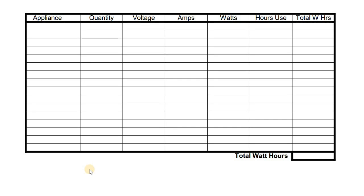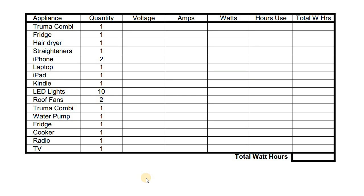Thanks to everybody who's commented on the videos — it's really helpful when you pick things up like this. So let's get into the load calculation. We need to assess how much power we're going to be using and size these batteries. To make it easy, I've designed this spreadsheet — I'll put a link to the Excel spreadsheet in the description below, along with a PDF version if you just want to write the loads in by hand. First thing we do is make a list of all the equipment we're going to be using in the sprinter, and write down the quantity of each item.